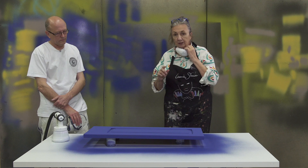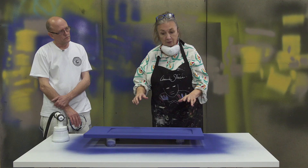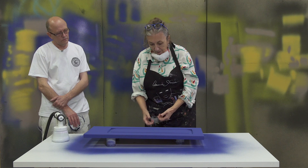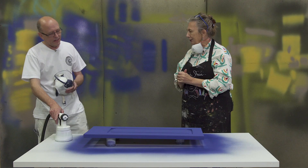Just a few points to remember. This is something we painted a couple of hours ago and it's now completely dry — we're very pleased with it. What you mustn't do is get dirt or dust on it. If you were to touch it here, anything like that, when you spray it, the varnish is going to bring everything up. So it's got to be super clean and beautiful.